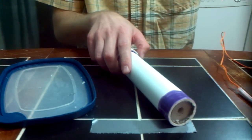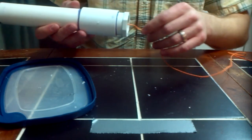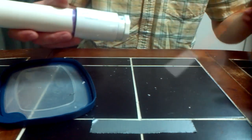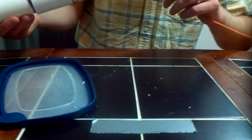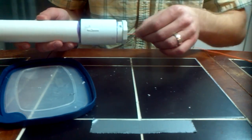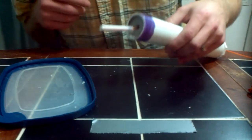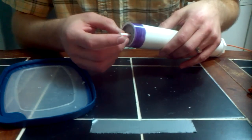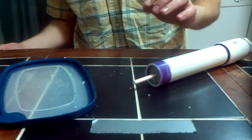Back to our pre-made igniter. What I'm going to do is feed this right up through the nozzle. The contact ends are 20 feet — this is a professional igniter that was given to me by a friend at work. Now what we want to do is, because this sipping straw igniter is not 3/8 inch, there's a little bit of play. We want to snug that into our Bates grain, and this is best done with some duct tape.